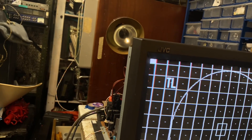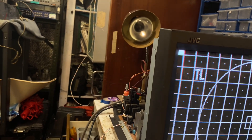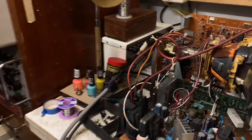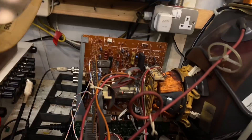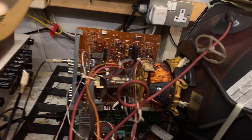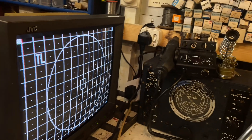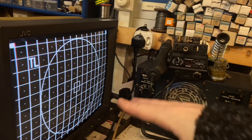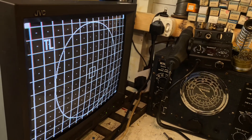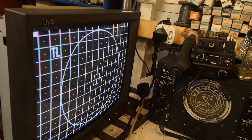I'm going to just touch up the focus again. The only fault remaining now - after I tidy up the wires - is to change the capacitors in the vertical amp. I've adjusted the linearity so the squares are equal, but we're still getting some cramping on the bottom and some strange effects, which is just caused by leaky capacitors. I'll change those and it should be all done.